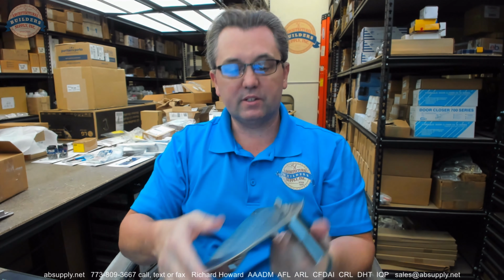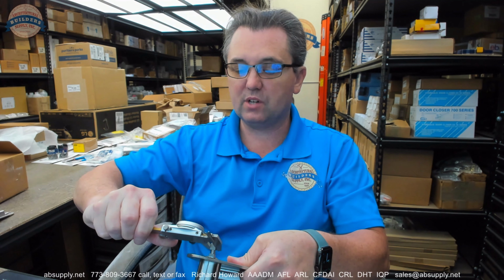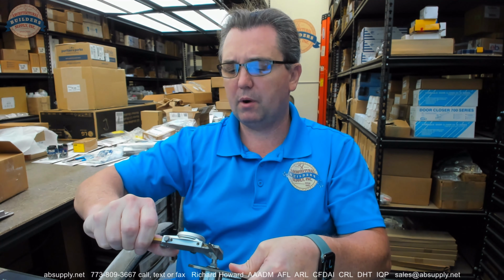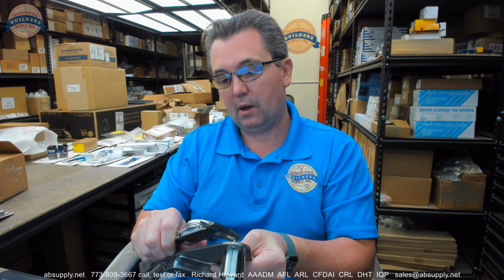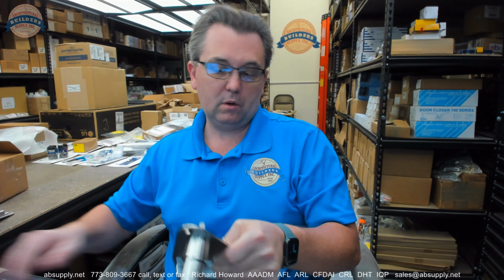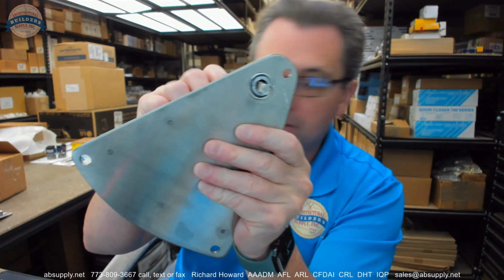The spindle that's coming out of the back, that keystock diameter, pardon me, the size of the keystock, 0.31, so 5/16. But that'd be a 5/16 spindle. That is clearly captive inside of there. There's a post that's holding that spindle in place. Okay, let's switch to the screen view and take a look at the catalog supporting documentation.